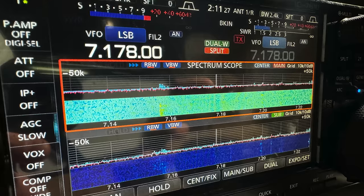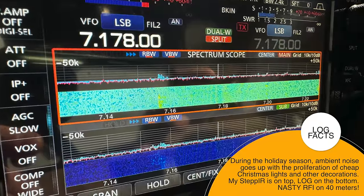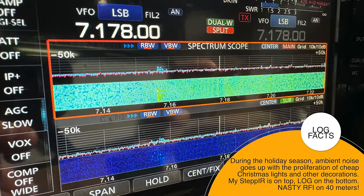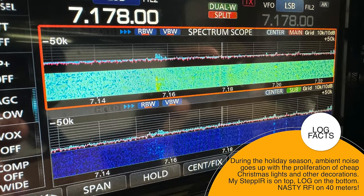What's the verdict — my opinion on the loop on the ground? Well, it depends on how you think about an antenna like this and what your home setup is like. I have an ICOM 7610 with multiple secondary receive antennas that I can have on the radio at any one time. I'm able to switch seamlessly and listen to one antenna on one ear and the other receiver in the other ear. I can devote a loop on the ground to one ear while listening with the other one. When I have high atmospheric noise with the StepIR, I can lower that one down and bring up the loop on the ground, getting really good clarity without bringing in so much of that noise background — that frying eggs and bacon type sound. You can mitigate some of that with the loop on the ground.